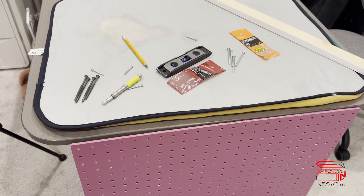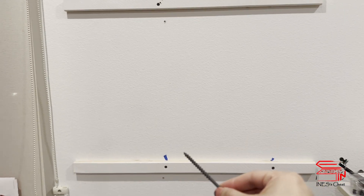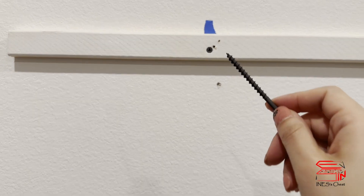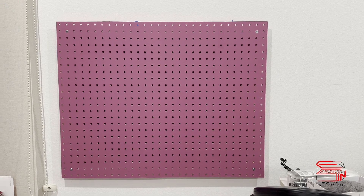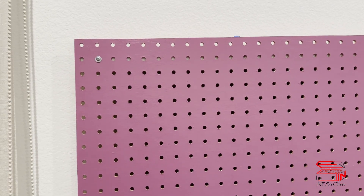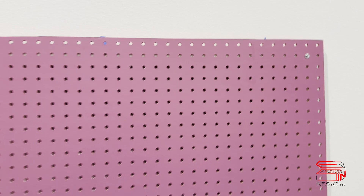We've got all our hardware and the painted pegboard ready to install, and the targeted area is here. The furring strips are on — we used three-inch drywall construction screws and fixed them into the stud. This was actually very difficult because we tried three times; the first two times there was something behind the wall and the screws just wouldn't go in because they're so long. But finally we did it. The pegboard is on — we used one-and-a-quarter inch nails with a washer to mount the pegboard on each corner onto the furring strip.